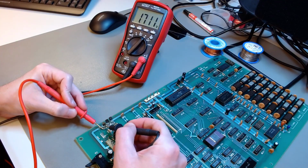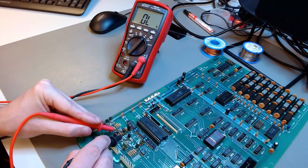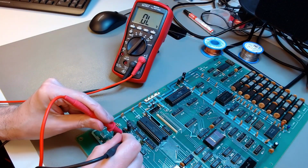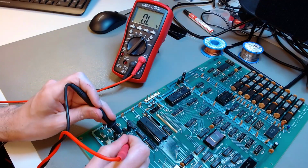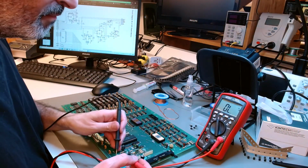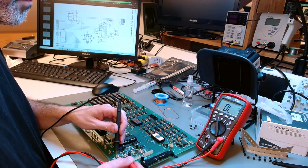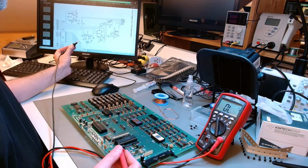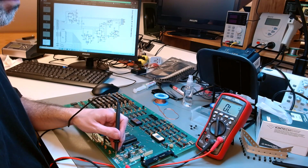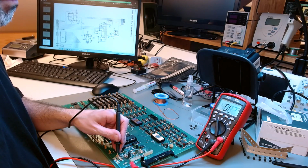So I was right on the threshold of thinking, should I change it or should I not? They are still okay, but the voltages are not quite uniform. So I decided to pull out the schematics and make sure that I understood the circuit, because I was making these measurements in circuit. So you never know what other paths are connecting the 2 points you're measuring.